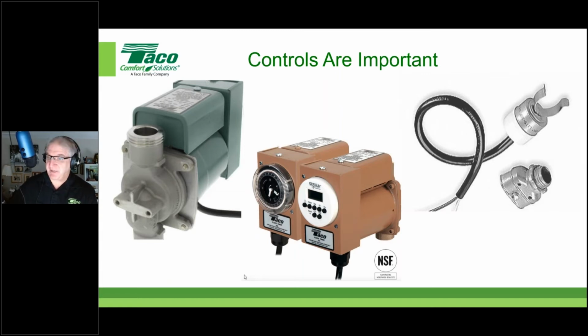Right, and it's a compromise between the most convenient place to put it and the most effective place to put it. The most convenient place is just on the inlet side of the circulator, because it's right there. The most beneficial place, as you said, is at that farthest fixture, because then who cares what the water temperature is between there and the mechanical room? True. We don't really care. That's the best place to put it. It's also the least convenient place to put it.